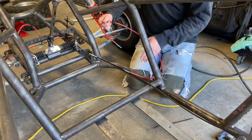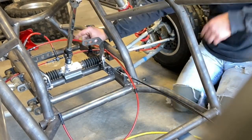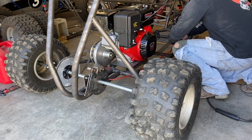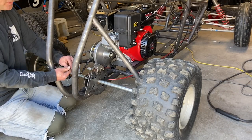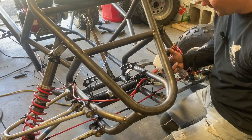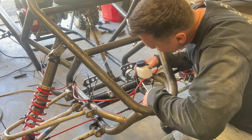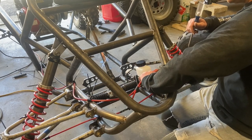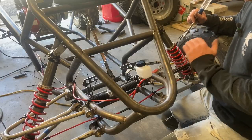All right, so now let's run the rear brake line. Now we'll just run the back half. Now I'm gonna use the banjo bolt that came with the kit just to get some fresh washers on there. And the last order of business is just connecting the reservoir. All right, now I'm just gonna go through and tighten up everything. All the connectors, all of the lines. Put this in, bleed the brakes, and we're ready to go. That was super easy.